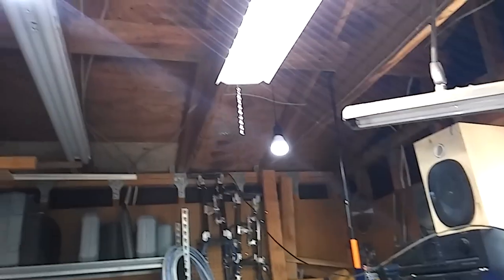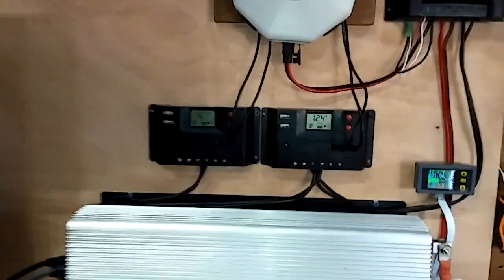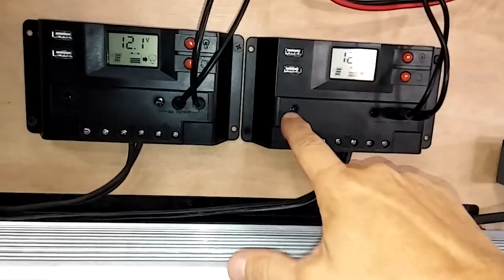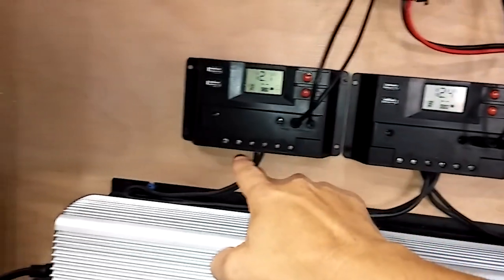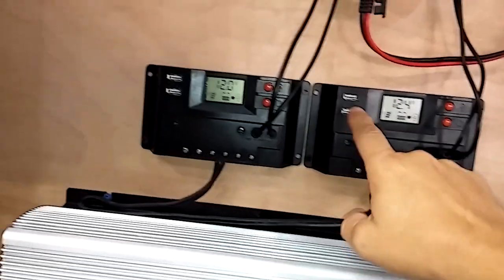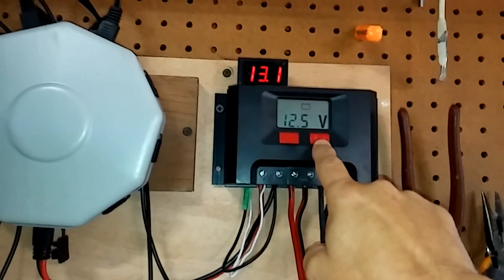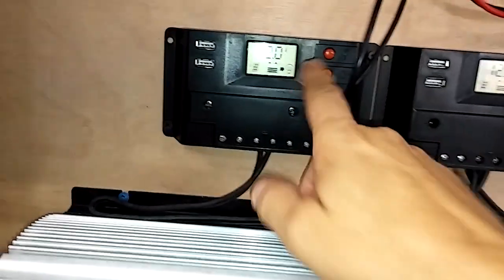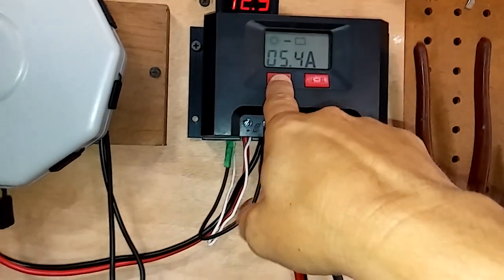Connected to the Jupiter, and those LED lights — the ones that come with the kit. I put these back on, but I'm not using them as chargers. I came off the load, ran to the battery side, and jumped that one to that one so I could run my little LEDs and keep my USB chargers. On the load side I can turn it off — see those LEDs turn off — and push it and you can see them light up in the background and they come right back on.